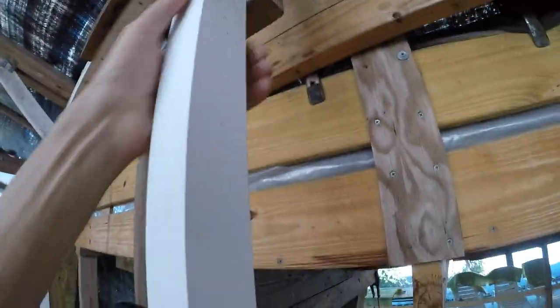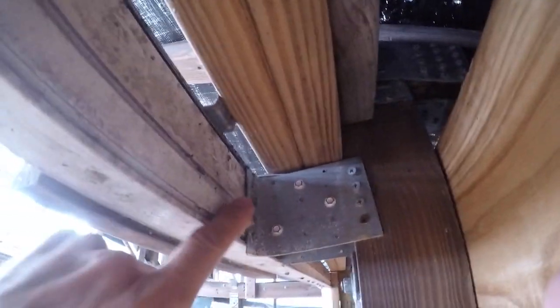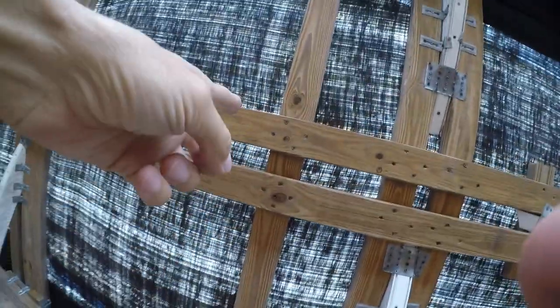This is the vertical post. This is how it is attached to the rafter. Again, metal plates everywhere. The metal plate attaches the old aluminum cage to the new 4x4. Same thing on the other side, as you can see. All right, so now this 4x4 ends here, and just that 4x2 continues as a rafter. Kind of goes along with these two because there is this self-mating beam from the old lanai that I worked into the whole structure. So they're connected together. More or less, this is like one thick rafter, you can probably say.